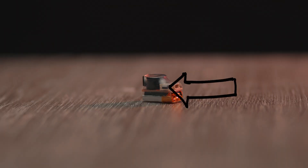Now I'm going to show you how to turn the beeper off. Let's say you lost the quad, it was beeping like that, and you found it. What you do is take your battery, plug it in for three to six seconds, then unplug it again. When you hear the three short beeps, that means the beeper is turned off. There's also a little button on the side of the buzzer, but on quads like this it's really hard to reach.